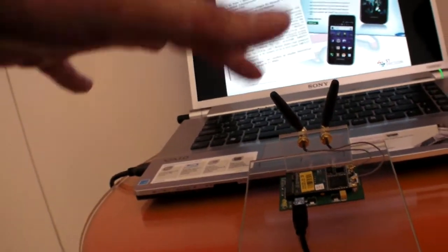And here there are two antennas — is that needed? Is that a new thing? What this is about is called RX Diversity. It means you have two receiver paths: one main antenna and an auxiliary antenna helping to sort out the interference constraints in the surrounding environment. This basically improves your performance in the solution.